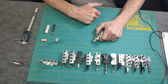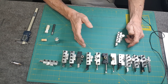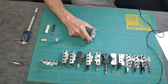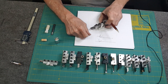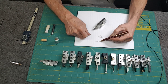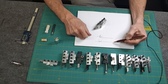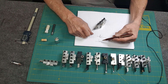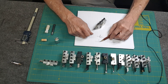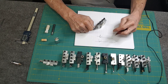A lot of people see me turning at an angle — going into the work and coming out — and they scream that I'm going the wrong way, that I should be going straight. The difference is that on a mini lathe, if I'm cutting at an angle, the force is constant outward and constant downward. You're smoothing the surface like a butter knife and I get fantastic finishes that way.